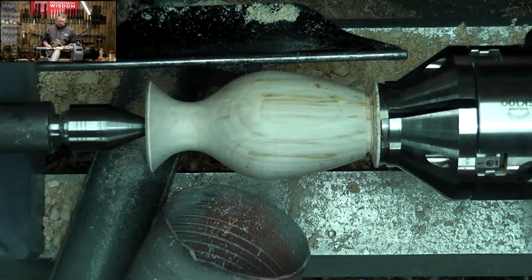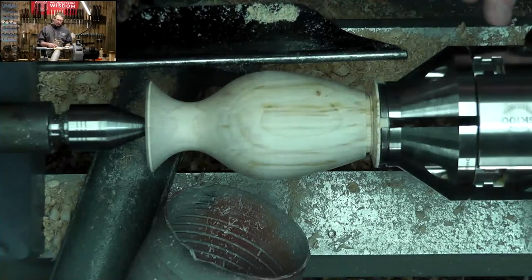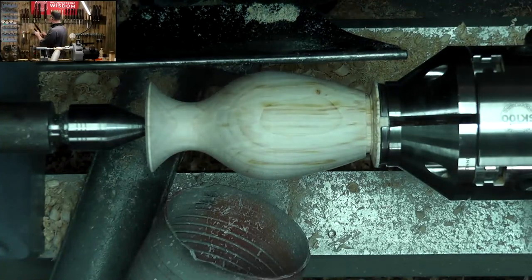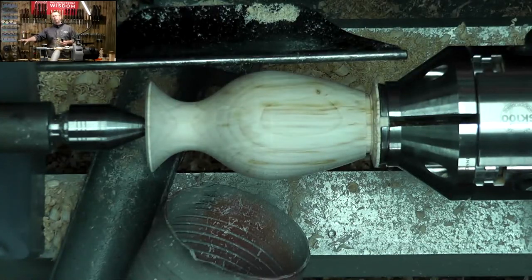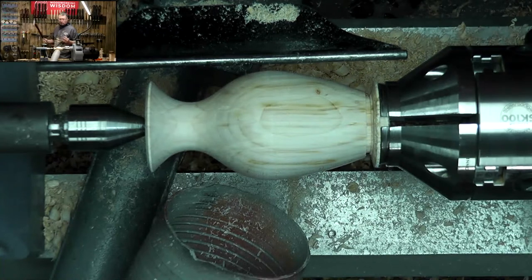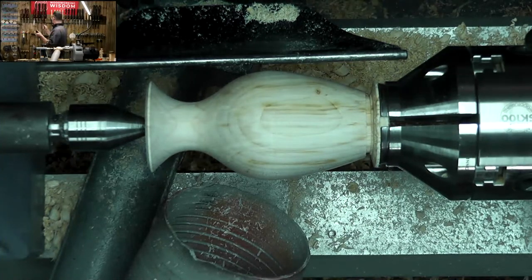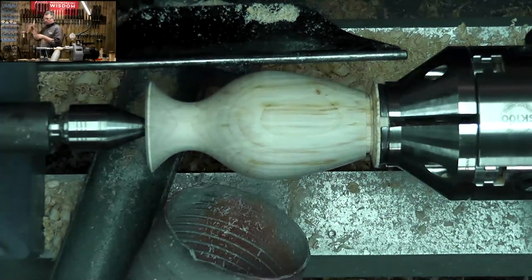So I really want that finish at this stage. We're going to sand it next. I really want the finish to be a good one. Think about, and this is something that I've said quite often, if you're doing a table leg or chair leg or anything like that, the reason that we start off with a really nice smooth surface is because that surface will be the high points of all of your details. So beads and V-cut sort of fillets, all those things, they can be that maximum diameter, and if they're not a good finish when you start, they're not going to be a good finish when you end. Yes, admittedly, coves and things like that, you'll take them down and change the surface, but the high spots you won't.